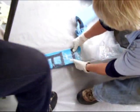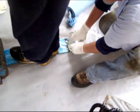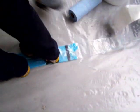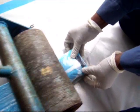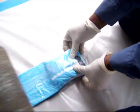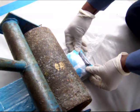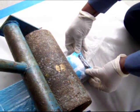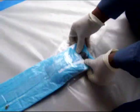You do not have to work the end of the liner by hand to be able to complete the wet out. The air end release plastic is then folded over so that the exact same method can be used at that end. The air end release plastic is then stretched out straight, and the excess epoxy is then rolled out into that release plastic.